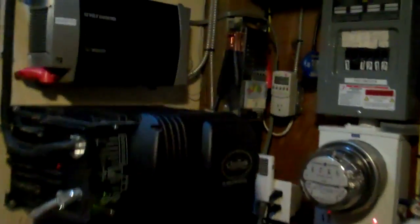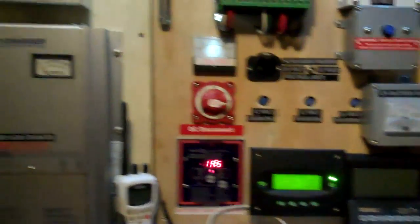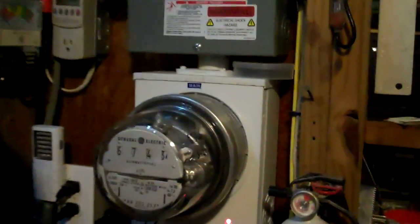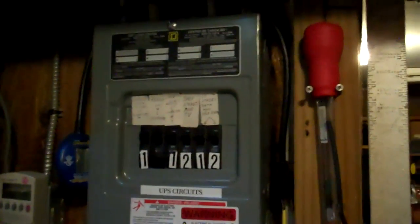The basis of this video is you need to prepare your house first — get it as energy efficient as possible, then you can add your solar. After you do that, you separate out your designated circuits and put those on your inverters with automatic transfer switches.